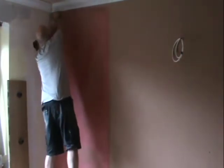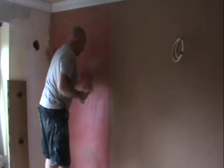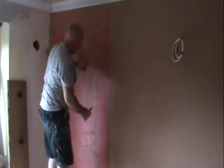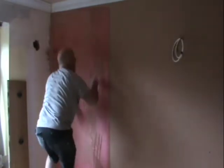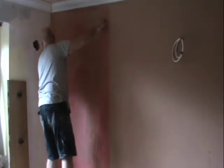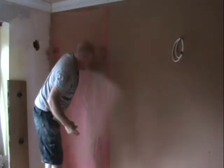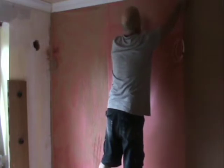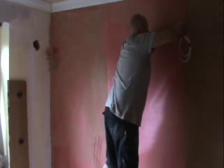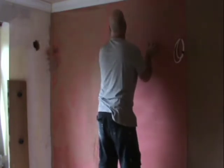From experience, when walls have been chopped about and replastered and cut out for all sorts, then bonded, and some of it's cement, some of it's bonding coat, I don't have confidence in a wall not cracking. You can't stop plaster from cracking. When you go to do a job, and a customer says, oh, can you guarantee it not cracking? The answer is no, because it's just foolish to do that, to be honest, because you can't guarantee it, but you can prevent it.